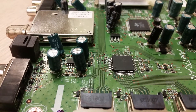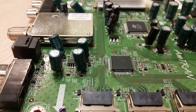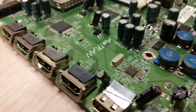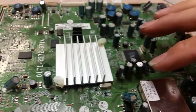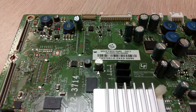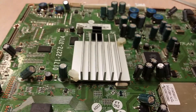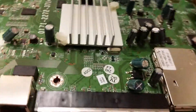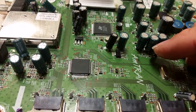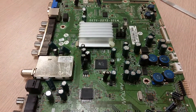If you want to see us returning the full amount, find a video from yesterday for a different board — actually the same type of board. It had missing fuses that were ripped off, and two voltage regulators that were poorly soldered. One of them had damage that wasn't seen until we went to replace it — the track had been cut off, and we had to patch that. Something similar may be happening here. That's going to take more time to fix and cost us more, which is why we wouldn't be paying the full amount. Thank you for your time, and talk to you soon.